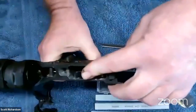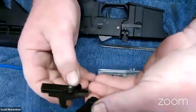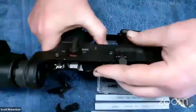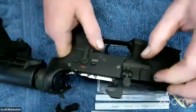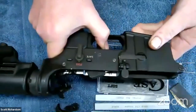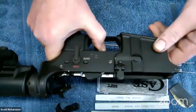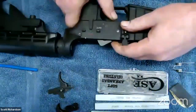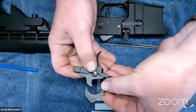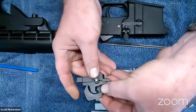If I pull the trigger, the hammer slams forward. What's happening is the sear drops, releasing the hammer notch, and the hammer goes forward. If I hold the trigger down, the whole assembly cocks back and with my finger down — on full-auto the trigger would keep slapping — but on semi-automatic, if I let the trigger go, you'll see the reset. The disconnector caught on the notch, then when I released the trigger it let the sear reconnect with the hammer.